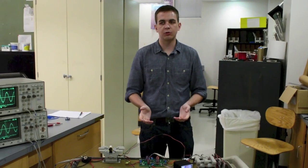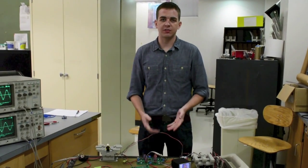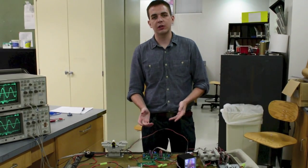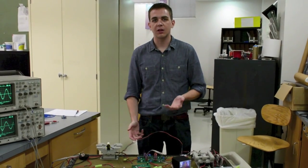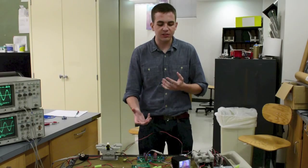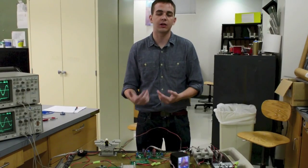This is meant to be a learning tool. It's very basic, and most electrical engineering students will understand it easily, especially those who have taken a power course such as energy systems or power electronics. It is called the Smart Grid Test Facility, but there's nothing essentially 'smart' about it yet — that will happen in the future. We are envisioning wireless communications, microcontroller-based relay systems, three-phase operation, and possibly patching into 802.11 networks so a student can see what happens when adjusting relays from a laptop elsewhere on campus.